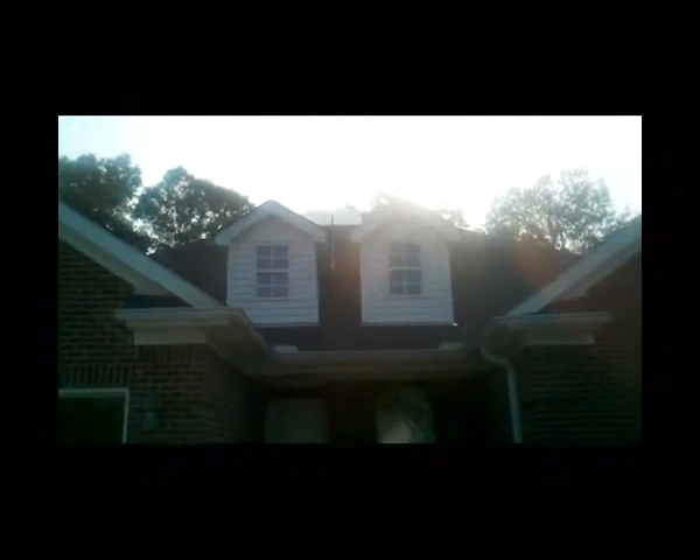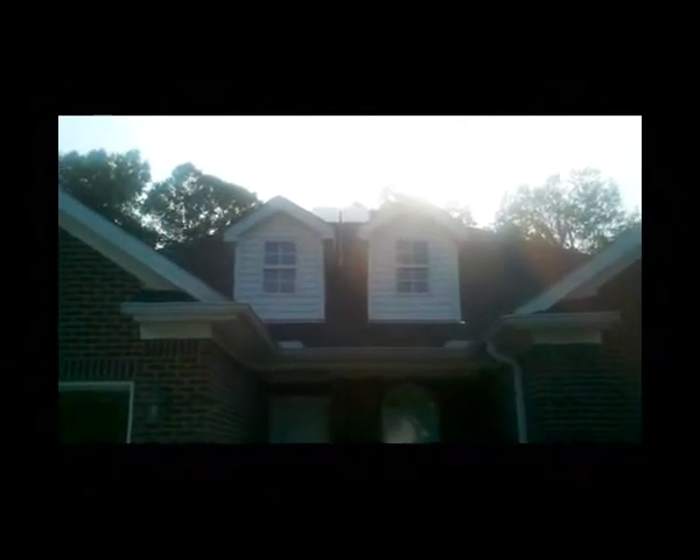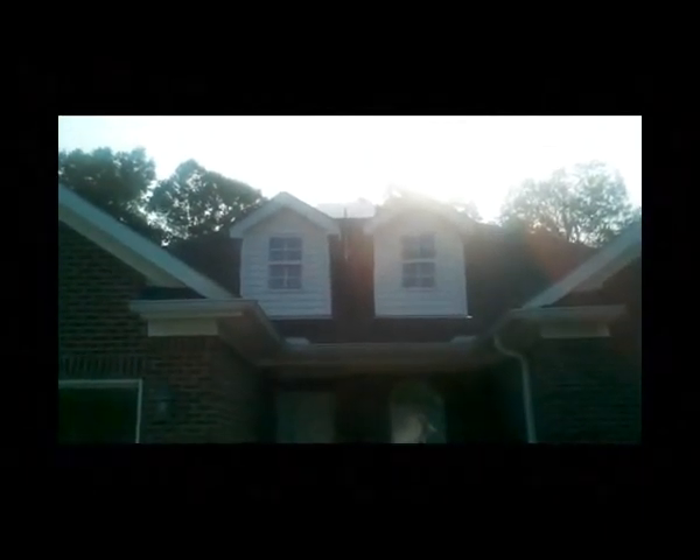This is an update about the finished product. For those folks not familiar with my other videos or trying to determine whether they want a backup system, I want to talk about my solar backup system. It begins with these two solar panels on the roof, tied together in series — two Kyocera panels, 135 watts apiece, for a total of 270 watts.